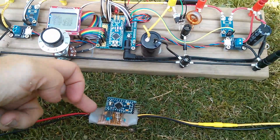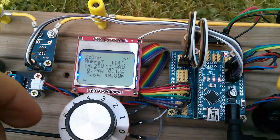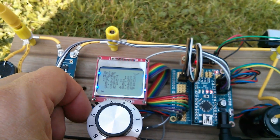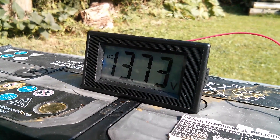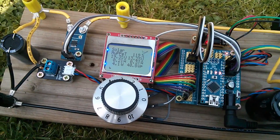So is it going to be a relatively easy task to take the algorithm that's in the PWM unit and incorporate it into the MPPT? Well I'm not so sure. If I'm playing with the MPPT unit and I've got the pulse width set fairly high and I notice that the battery voltage is climbing too high, my natural reaction is just to back it down to a lower PWM percentage to pull the battery voltage back to a more normal float voltage. But I'm actually now considering implementing this in a slightly counter-intuitive way.